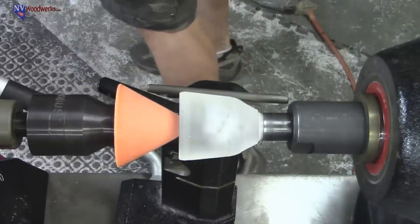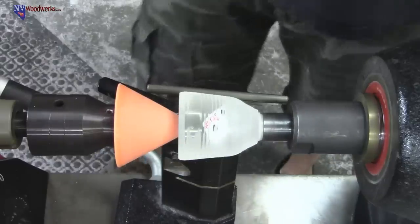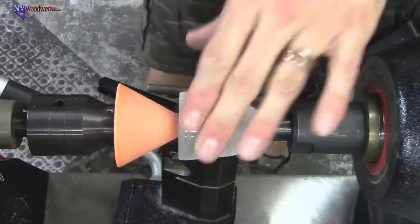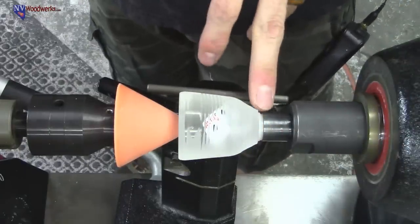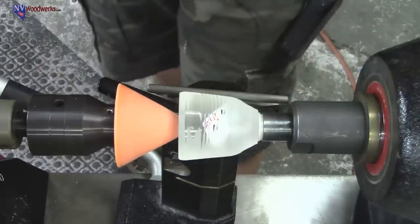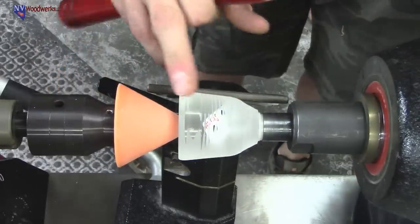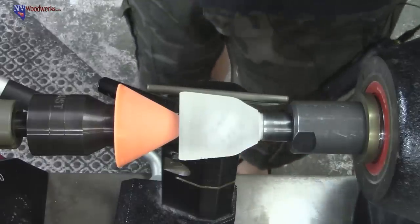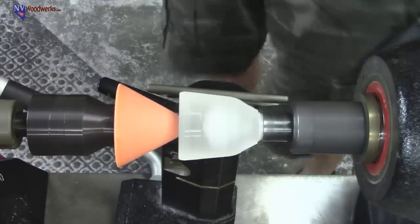So if you do a bunch of resin stuff, definitely. These don't help out with regular wood. They're made for resin and things that are catchy or brittle. If you're turning really brittle polyester resin blanks that are really chippy, or some of the other acrylics that are super brittle and tend to chip a lot, they totally tame those kinds of resins. So I'm a big fan of these things. It was a game changer for me.